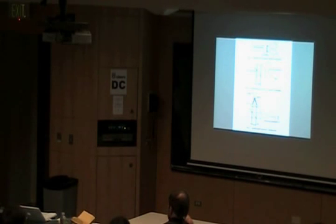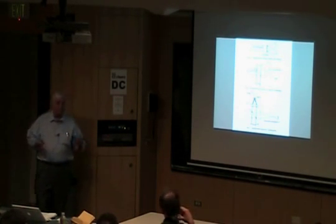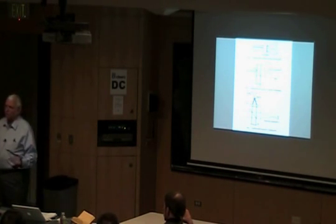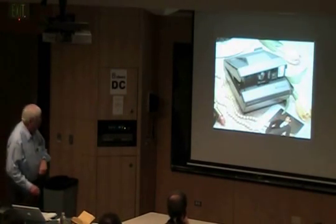But when you have a hologram, you've got images on both sides. One's inside out and one's right side out. You use the other image, and it thinks it's looking at a lens when it's looking at the mold cavity, or vice versa. So now you can do a direct interferogram to measure your freeform against what you thought you were trying to make. Of course, they'll never get better than your mold, but that's not going to happen anyway. Right? So what happens next?